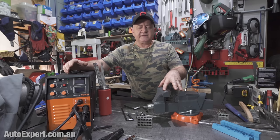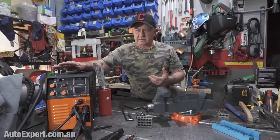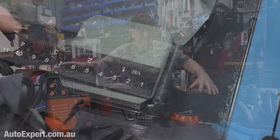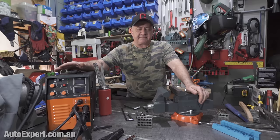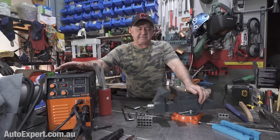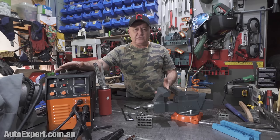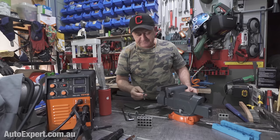It's made of ductile iron — and I know all cast iron looks the same, but it's really not. Grey cast iron is what they make fry pans for camping and drainage grates out of, and it tends to be very brittle. This is not that. This is much more amenable to the kinds of abuse you'd deliver in a workshop. It's also got a little anvil — about 70mm by 70mm — good for straightening bent washers and nails. It's a swivel vice, so you can unlock the little toggles, which I'm going to replace with M10 by 1.5 socket head cap screws for commonality — then you just need one Allen key and you can do it all.